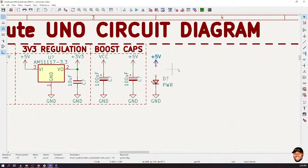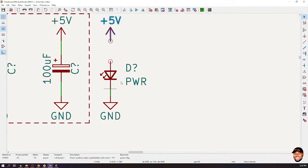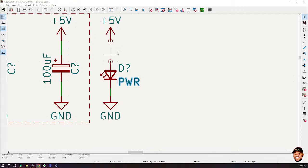However, there is a little problem. Since you're going to use a red LED here, the forward voltage for a red LED is about 2.1 volts. That means that if we put this voltage there, then remember our first session, sometimes the energy source is more than the load requires, sometimes the energy source is less, sometimes it is equal. Unfortunately, it is not equal, it is more. So the question is, how do we deal with the excess voltage? Because we only need 2 volts here. And we also don't want the LED to be very bright, so we allow only a current of 10 milliamps through it. So with a current of 10 milliamps and a voltage of 2 volts, we will have 3 volts to deal with. The question is, how do we deal with these 3 volts?